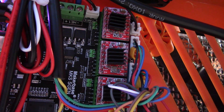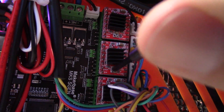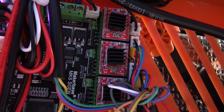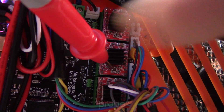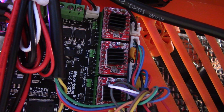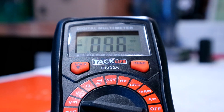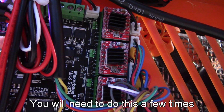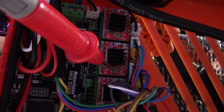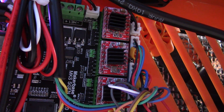Being careful because I don't have a ceramic screwdriver, you just turn the screw slightly counter-clockwise. I was at 0.98V. Park the connector right there, touch the ground — I am at 0.84V. It's very difficult to adjust. I moved it up a little bit. Park the probe inside the screw, touch the ground — 0.90V. And now we have 0.95V, so this is good. You do this for all four drivers. You aim for between 0.95V and 0.96V.